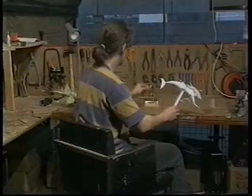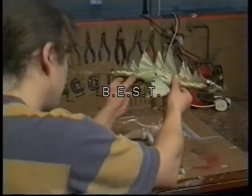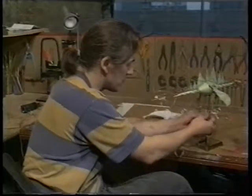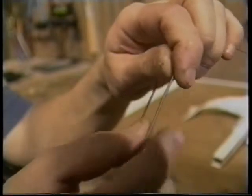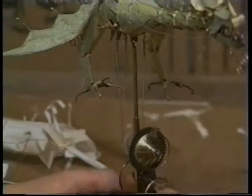When I actually come to making this from brass, the base would probably be quite similar to this one. This is a dragon that should just slot on. The mechanics on this dragon are the same as the mermaid. The drive belt used is a commercially available type used for model steam engines. Like the elastic band, they're springy and stretchy, so you get plenty of friction. Unlike the elastic band, they're a lot stronger and don't stretch quite as much. There's enough friction to drive all the parts in this dragon.